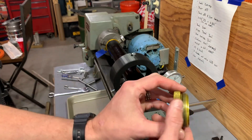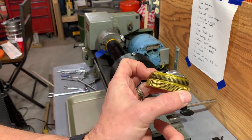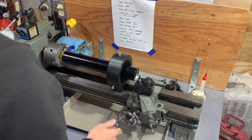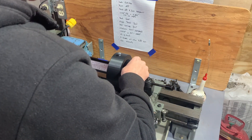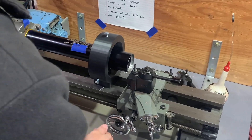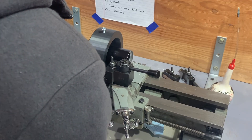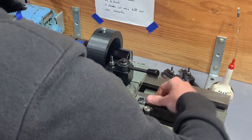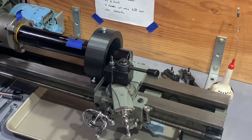We're trying to match this — it's like a 2.05-inch, 24-thread-per-inch thread on the closures, and we're hoping that'll fit inside there when we're done. I'm going to start by just parting this off. The case should be like 11 and 5/8ths. I put myself a little scratch mark there. I'm just going to use some high-speed tool bits for this part. Got the right length — going to lock the carriage and cross-slide for a little more rigidity. All right, we're going to start by parting this off.